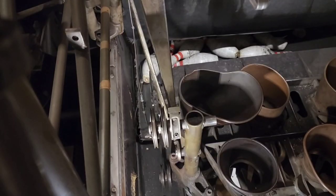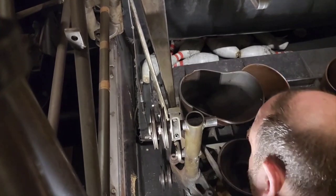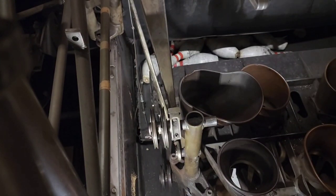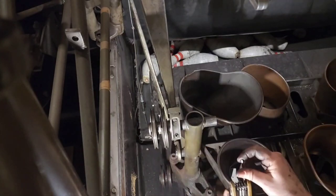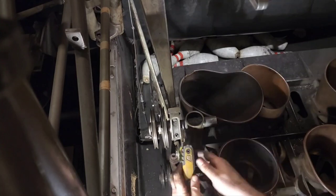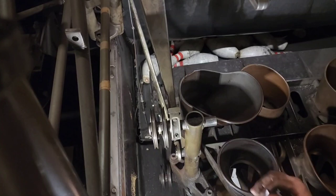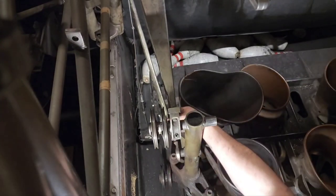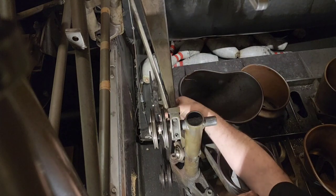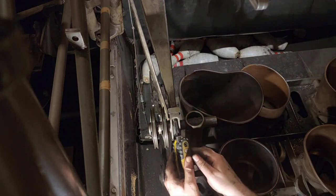Move down to the deck post bearing caps. We're going to remove the top and bottom screws here. Wrong size, wrong size again. You guys didn't see, but the stabilizer rod jam nuts got broken free and the stabilizer rods got threaded and unthreaded until I found kind of a neutral flippy-floppy point.